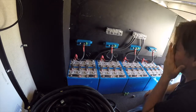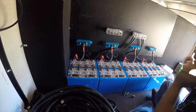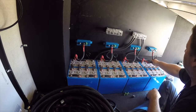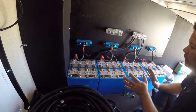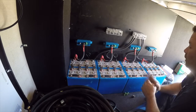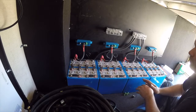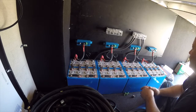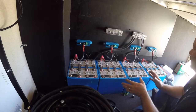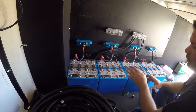Last weekend I went back to the house and made up these battery cables. The goal here is to ensure that we have the same length of cable for each battery. Some batteries have more resistance, some have less, and there are variables we can't control — so we at least want to control the length of the cables.